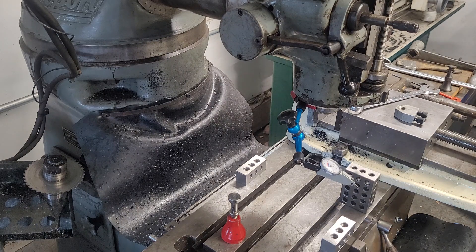That's a little frustrating — it makes it harder to drill square. In this case I'm just going to live with it. If I'm doing tool-room ten-thousandth-of-an-inch tolerances I would have to buy a new machine. I work in one-to-three thousandth tolerances on the tight end, and frankly on a lot of stuff it's layout lines and send-it tolerances. So do I need to be more precise? Not really — this is still a plenty tight machine.